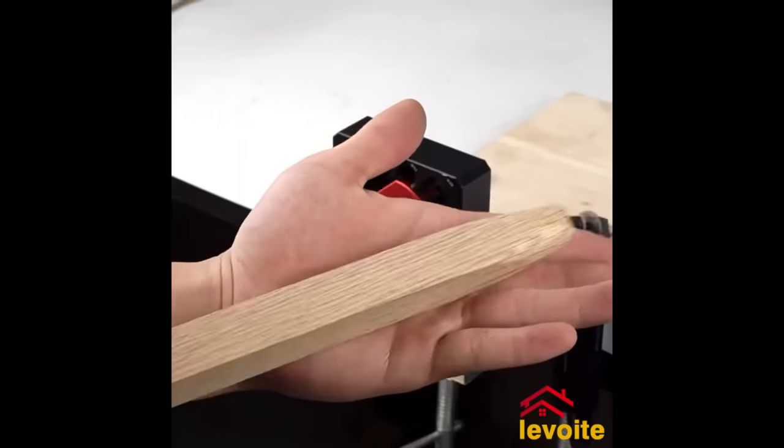The FastDecMate is the ultimate tool for flawless wooden deck installations. Specifically adapted for board widths of 95, 120, and 145mm, its hole pattern aligns perfectly with Swedish Wood's latest plank laying recommendations. When you're splicing deck boards, simply flip the deckmate, mark as directed, pre-drill using a 3mm bit, and then secure your board. This method significantly reduces the risk of end timber cracks. It's optimally designed for a 45mm rule.